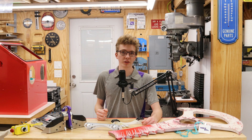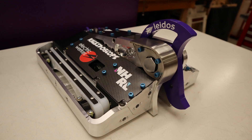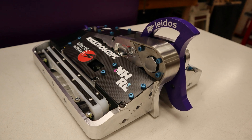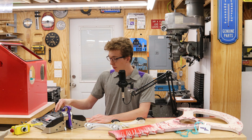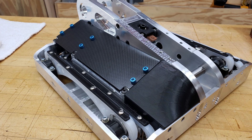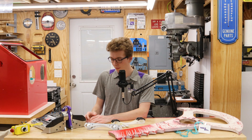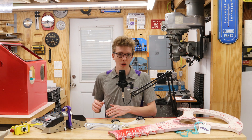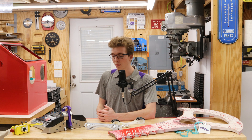A couple other changes you can see on the outside of the bot is a greater use of carbon fiber than last time. All of the carbon fiber panels you see are sixteenth-inch thick, as opposed to the Garolite that we used last time, which is kind of just a budget version of carbon fiber. A couple of the back corners on the robot are also printed out of TPU, and we're utilizing TPU extensively inside the robot to help hold all of our electronics in place. I've been pretty happy with the TPU because it's allowed us to shock-mount things, and it's very simple and easy to prototype on our printers.